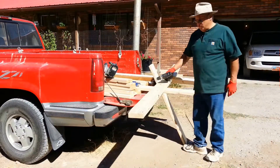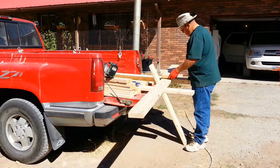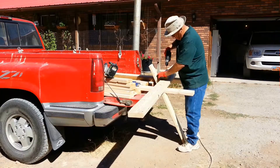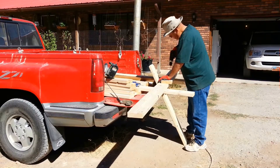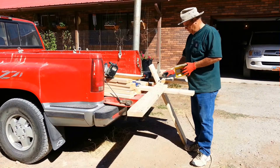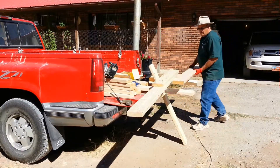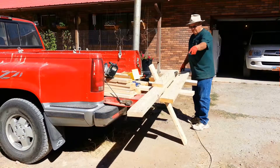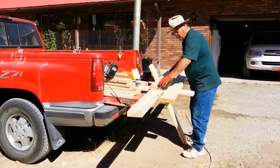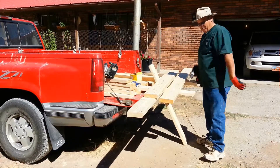This is going to be the same drill as before. We're going to drill pilot holes in this splice and then we're going to put the construction adhesive in between. So we won't show all of that, but let's put the pilot holes in. Now we're going to drill the pilot holes in this board instead of putting the other half on that side, because we're going to have to turn it over or we won't be able to put it on our little jig here.